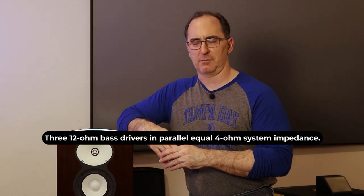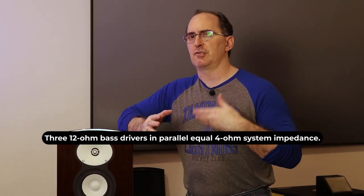The Salon 2 is rated at a nominal 6 ohms. Meeting the IEC standard for 6 ohms means the impedance drops below 4 ohms at certain frequencies — a harder load for many amplifiers. The F-328, on the other hand, is rated at 8 ohms. I'm wondering if the impedance dips into the 4-ohm range with three 8-inch woofers; I'll be measuring that in my formal review. But generally speaking, this speaker has higher impedance than the Salon 2, it's more efficient, and it's easier to drive — that's the bottom line.